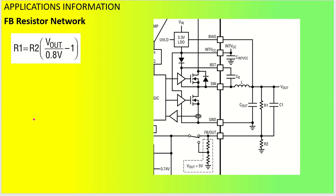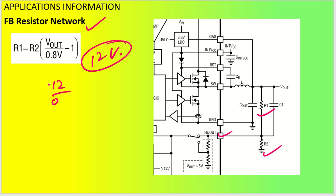For the feedback circuit design, R1 and R2 set the output voltage using the formula: R1 = R2 × (Vout / 0.8 − 1), where 0.8 volt is the reference at the FB pin. For a 12 volt output: R1 = R2 × (12 / 0.8 − 1). Choose an assumed value for R2 and calculate R1 accordingly.